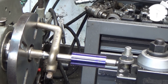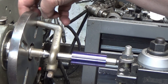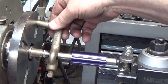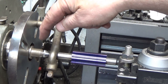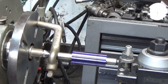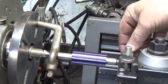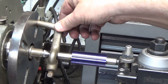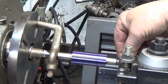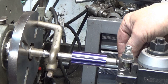Here's the new setup. I got a faceplate in — it's something that I've been actually looking for for a while. I jury rigged the center; I've got to get a new center for this lathe, but I jury rigged the center and I cut that true. So now I have the mandrel being driven by a dog and it's set up between two centers.